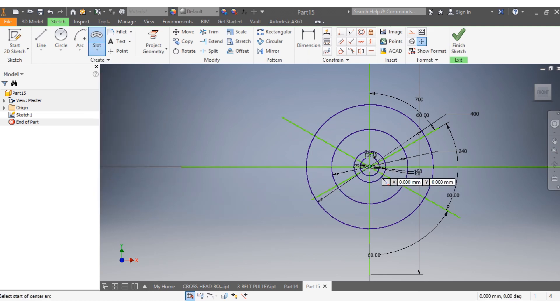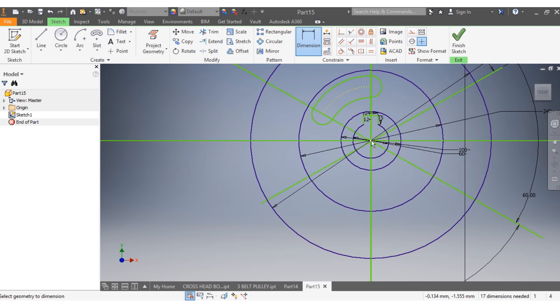I need to give the axis of my slot, so I go from here up to there. I want to go from there to here, then up to there. I want to give a dimension — from there to here to be 85 millimeters. That needs to be 85 millimeters.